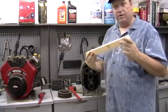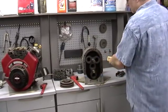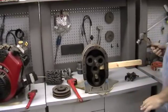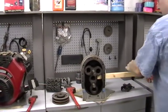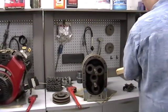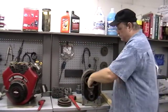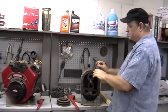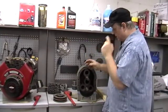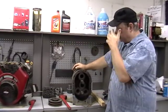This is what I've come up with and it works every single time. Once you lubricate your blower, get you a 2x2, put it in the blower against the load, take a large heavy hammer and hit it — actually physically knock the rotor. Now once you move it just that little bit, then you can put your pipe wrench back on there and it'll free right up. Once the blower moves any, just the slightest amount of movement, it's free. Just make sure that at the end of every day you lubricate your blower — and that's why.